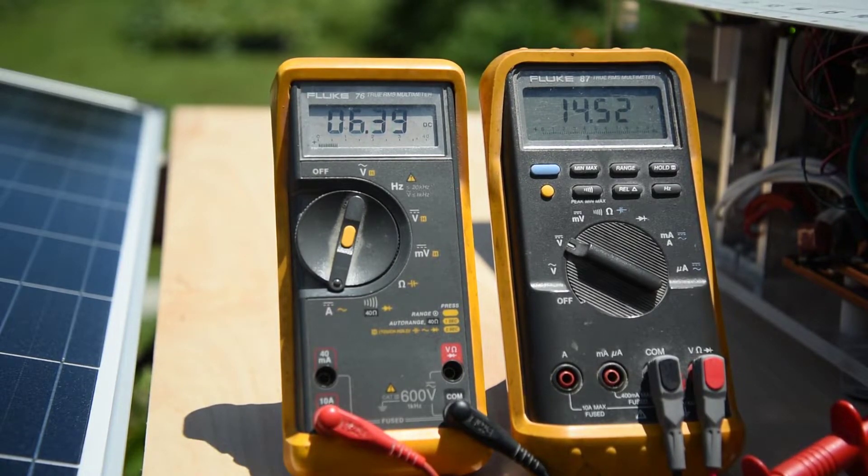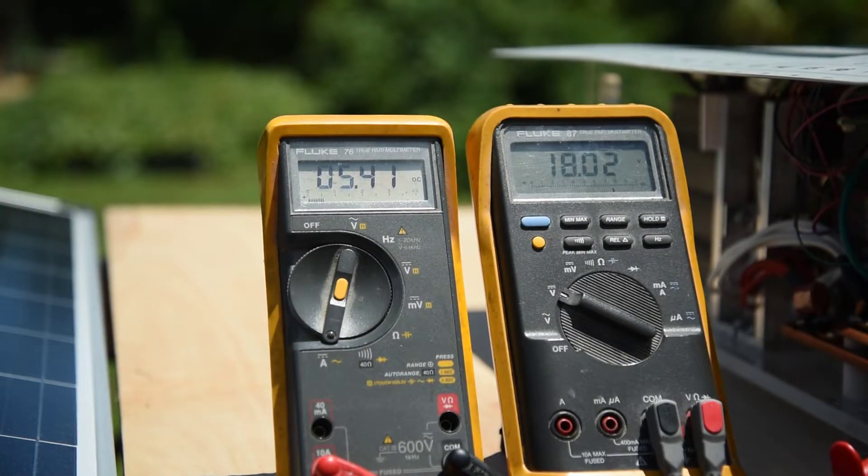About 6.4 amps is the maximum current, but the voltage has dropped quite a bit. The manual lists output voltage of 18.9 volts and 5.81 amps at max power. I'm only getting about 4.5 amps out with the voltage at 18.9 — that's about 87 watts. At a 5.4 amp load, I'm at 18 volts, about 97 watts.